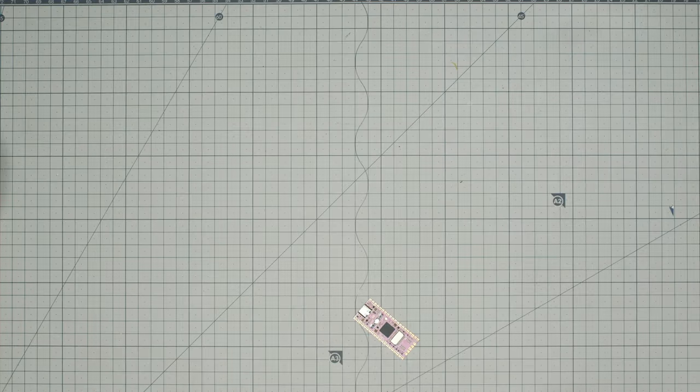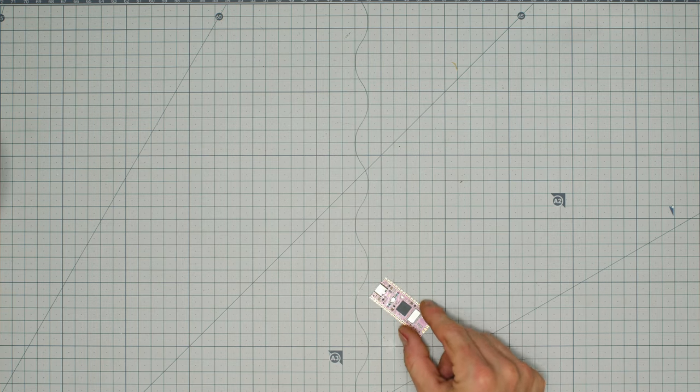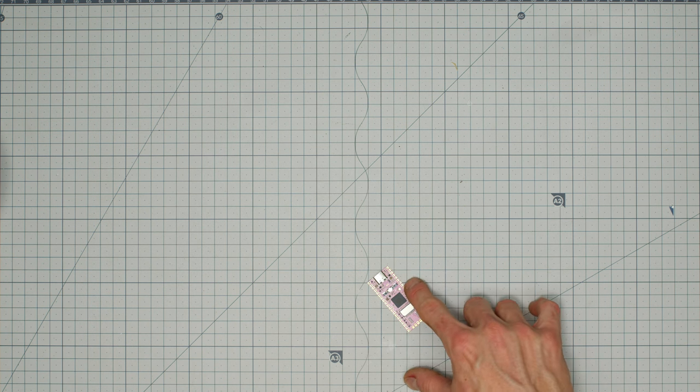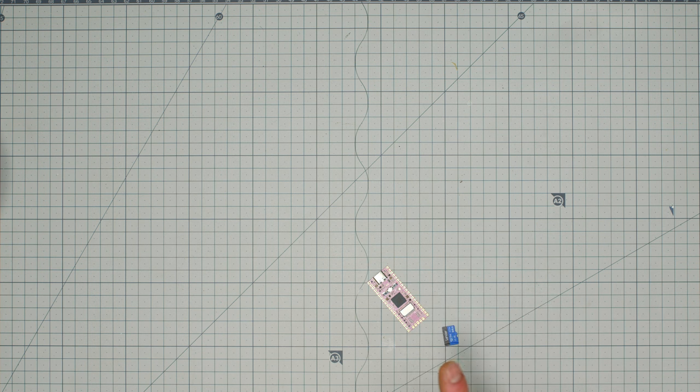And I want to say, you know, what else is new? The 1.0.7 image was only just released 30 days ago or 28 days ago, so I've downloaded it, I've stuck it on an SD card. We're gonna boot it up, just see what's in the image, if there's anything different. Have a look at the cat /proc/cpuinfo to see if we can see the ARM core from there. Stick a multimeter on that pin to see whether it's by default pulled high or pulled low. Then we'll pull it in the other direction and see if it boots back up. I'd assume not. I'm gonna assume this image doesn't support the ARM core, but I'm curious. You're probably curious too, so we're gonna find out.